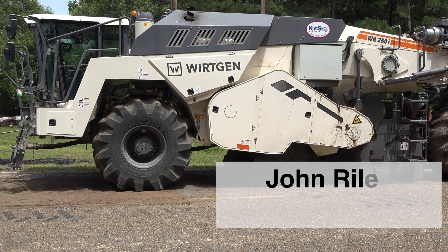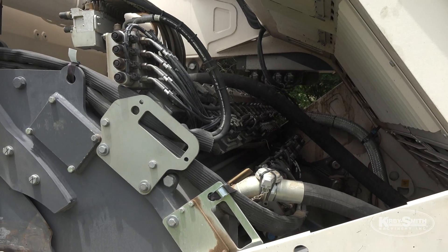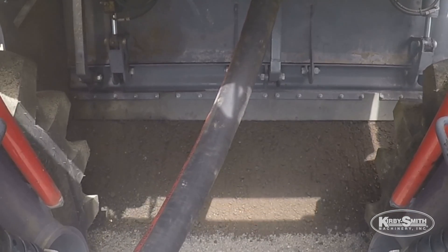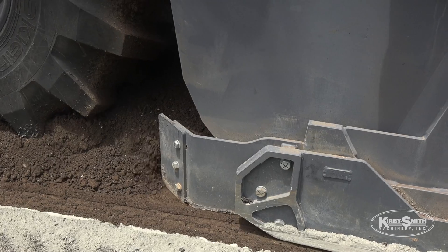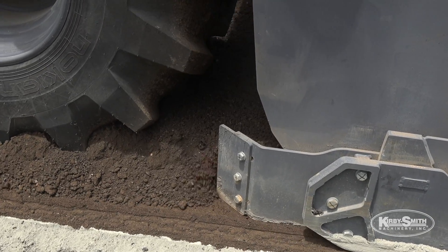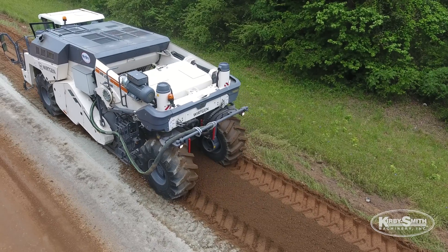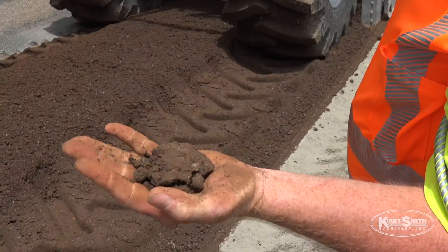The WR machine uses a large drum with sharp cutting teeth, breaking that asphalt up and mixing some pre-laid cement powder and some pre-laid RAP, along with bitumen which goes through a spray bar to create a foaming process — a lot like shaving gel. The foaming process expands and grabs those fines from the cement powder, then contracts again and wraps the larger chunks of the RAP with a paste of the fines. When it hardens it produces a very firm yet flexible base.